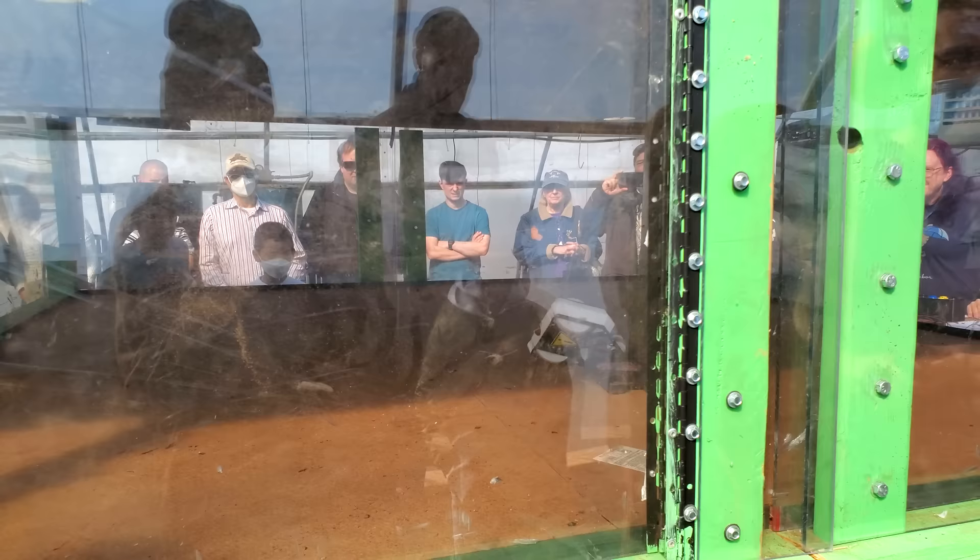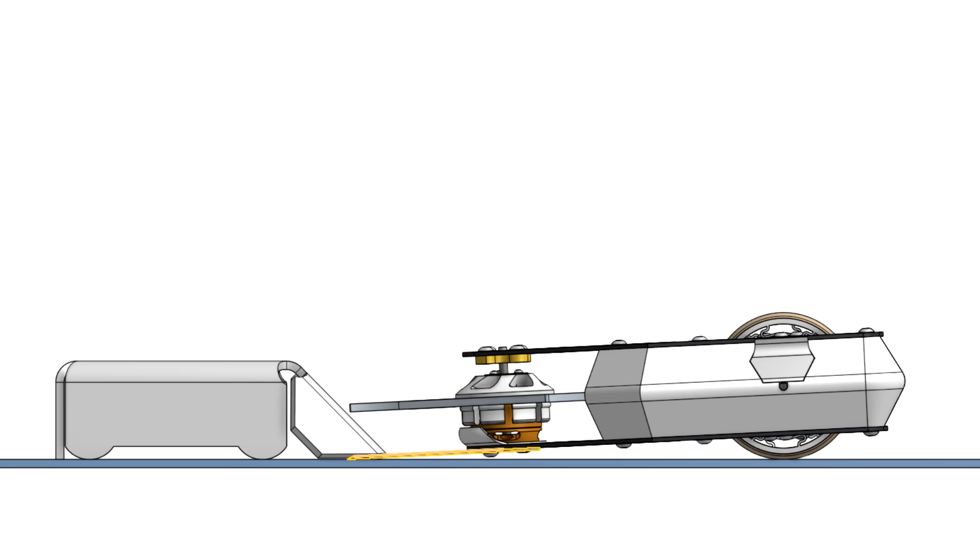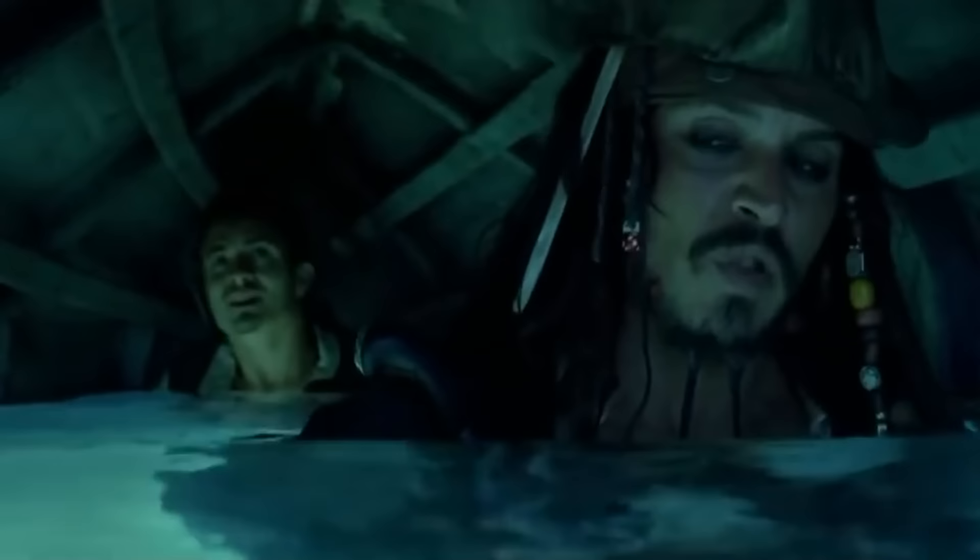But how does a fork help a horizontal spinner like Cheesecake? Normally when I hit a wedge, I go flying upward while my opponent stays on the ground. My hope is that if I can get this fork under my opponent's wedge, it'll hold me down and allow me to transfer more of my energy. Or it will lift my opponent up into the air with me so my opponent doesn't get the better of those exchanges. Or this fork will break my entire frame as I try to contain all that vertical force. This is either madness or brilliance — it's remarkable how often those two traits coincide.